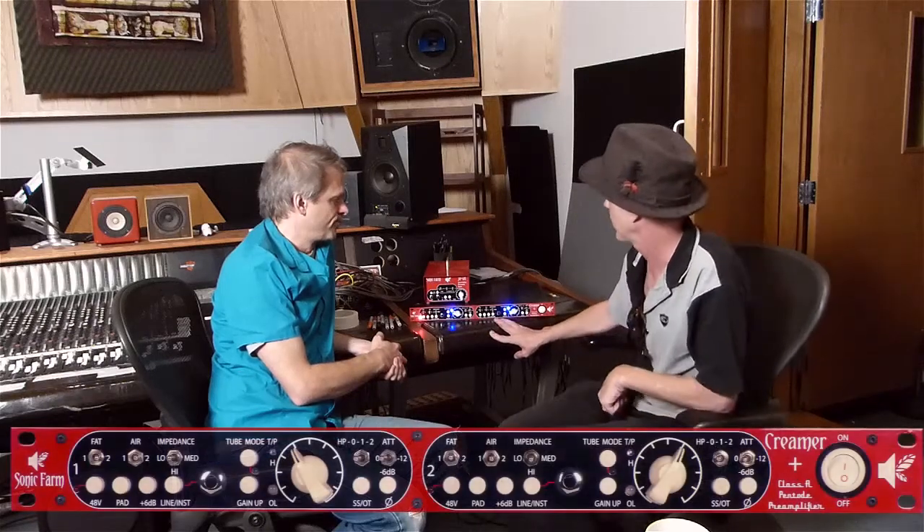Later, people wanted louder radios, so they came up with the pentode design, which has five elements. It's louder and — I'd say — more American-sounding, kind of like the difference between a Fender amp and a Vox amp. It has a fatter tone in the bass. When you push that switch it might pop, so turn your monitors down because the output will be louder from the pentode.